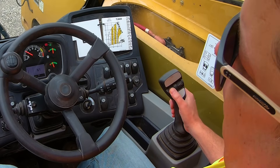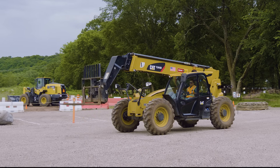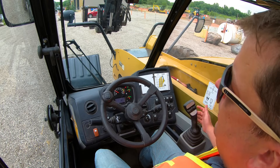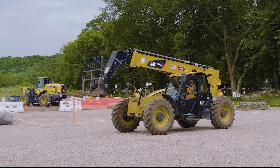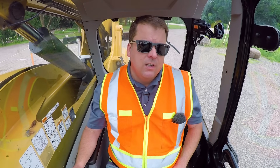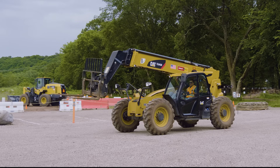On this machine there's a little thumb roller on the joystick. If you push up on that, it'll roll the forks down. If you pull back, it's going to roll the forks back. This will hold whatever angle you have — so if you curl it up all the way, it's going to hold that angle as you retract the arm. That's why in the next video we'll talk about transporting — it's important to get these things level, right at eye level. On the right thumb, I have a tilt function — if I go up, it tilts the forks to the right; if I go down, it tilts the forks the other way.